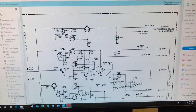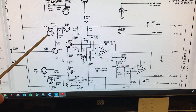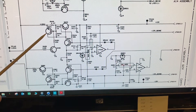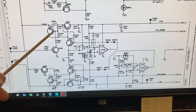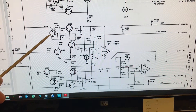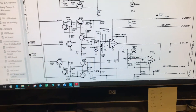I got to looking around some more — I've got the schematic up here on my computer. This is the schematic of the power supply for the unit. It ended up being Q401 right here, which is part of the 15 volt regulator circuit. There was a short from base to collector on this transistor, and that was causing the 15 volt rail not to work.